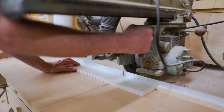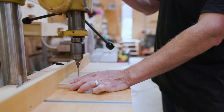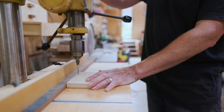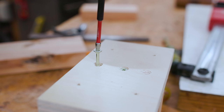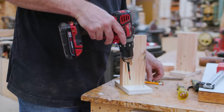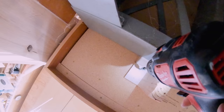So I made two wooden brackets, which were simply a piece of plywood that would screw to the underside of the table, then a piece of 2x4 that would hang down and make some structure for the rack to hang off of. So I just needed to drill a bunch of holes for screws. I made sort of a plywood plate, and I could attach that piece of plywood to the piece of 2x4. Then the tricky part was going to be attaching this little assembly to the underside of the table. So I put the screws in first, then I could put the bracket in place. It actually wasn't too hard — I just had to get down in all of the sawdust and cobwebs.